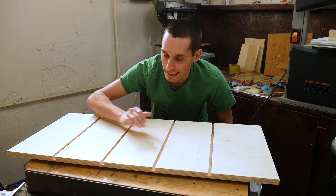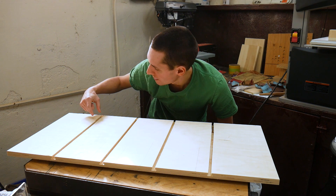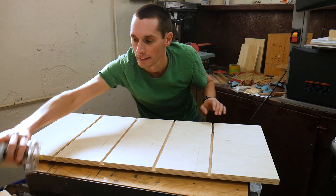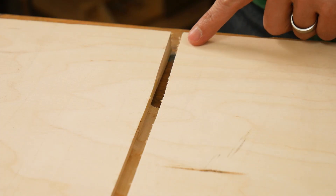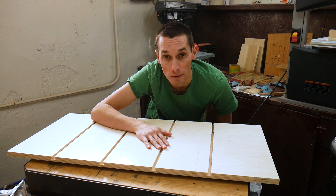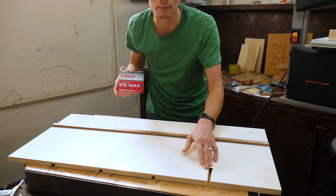The routing is done and it worked out okay, but I made a couple of mistakes. Over here I forgot to double-check the alignment when I was using the T-bit and kind of screwed it up, so that part isn't really usable. And then on the last groove, the T-bit started to come loose from my router and slid out, causing it to cut all the way through. But the nice thing about making a jig this way is it's very easy to come back and make more grooves — it's really not a big deal. Now I'm going to flip this over and apply a quick coat of paste wax to make it slide on the table saw a little easier.